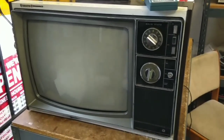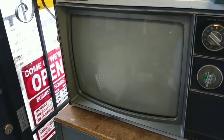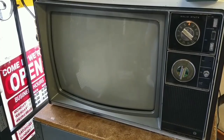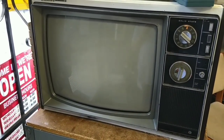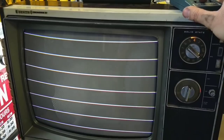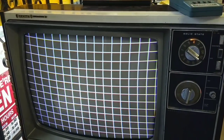It's all back together. It's time to see if our efforts paid off — if it flies or if it fries. We get high voltage, that's a good sign. It's warming up. Look at that — minimal blooming. That's good, makes me a little happier. Interesting how my convergence is off. Convergence is way off. How weird. Maybe that has something to do with the high voltage.